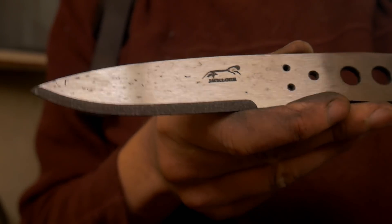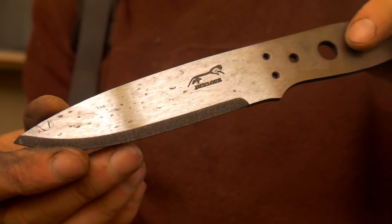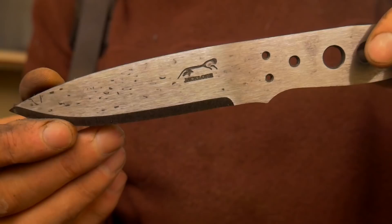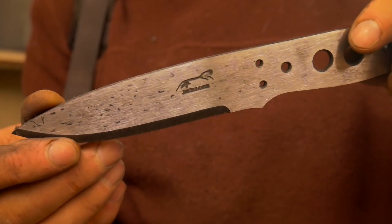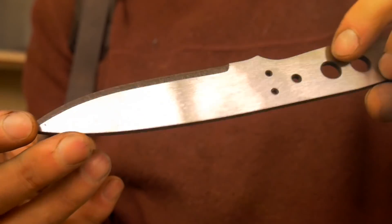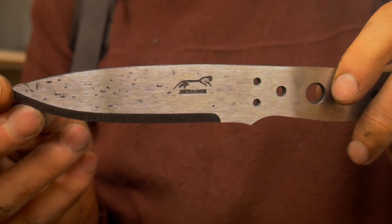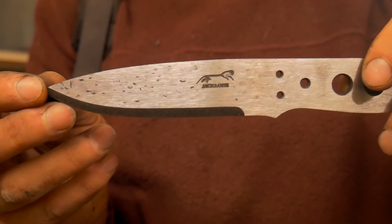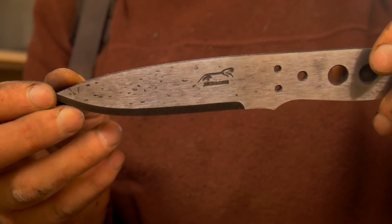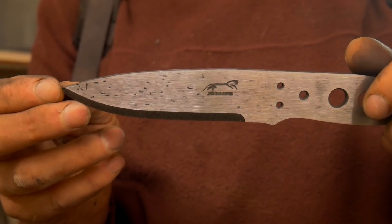You can see some decarb. The blades are cleaning up — it has protected the blade to some extent — but it's taking me twice as long to clean the blades up after the quench compared to what I did with ATP641. So that new stuff, I wouldn't say is as good as ATP641.